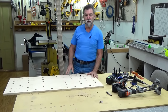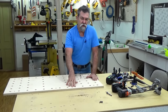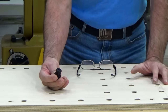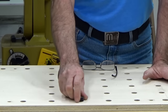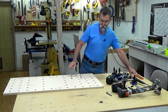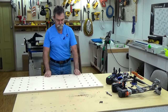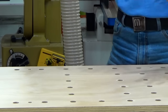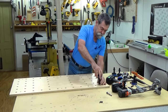Now all that's done. I was going to chamfer the top of each of these holes, but I decided not to because I realized that all of the dogs that I use have already got a chamfer on the end, so they go in very easily. There's no problem with that — in they go and it's done. Want to see the legs on? Let's do that. I'll flip her upside down. I've waxed this side — that's how the other side is going to come up in a minute. Let's put the legs on.